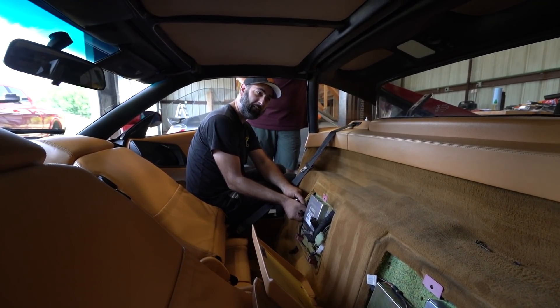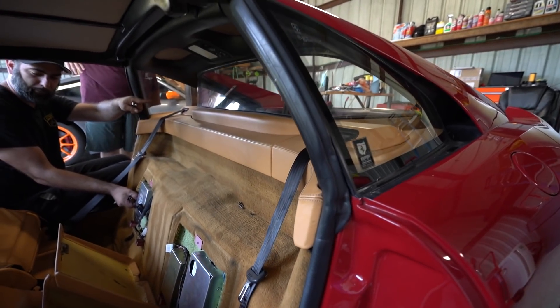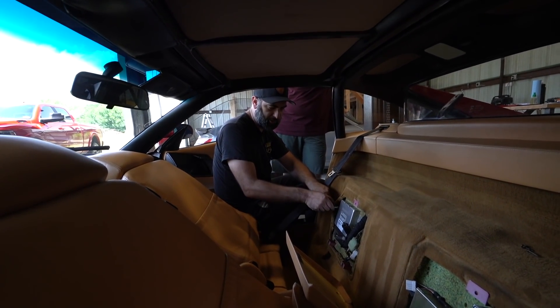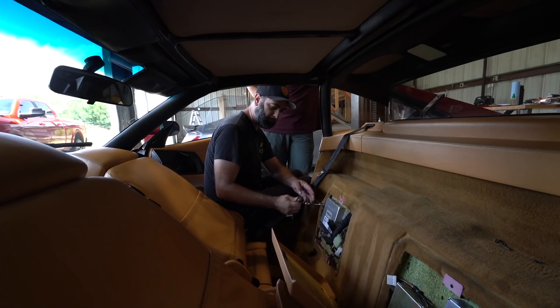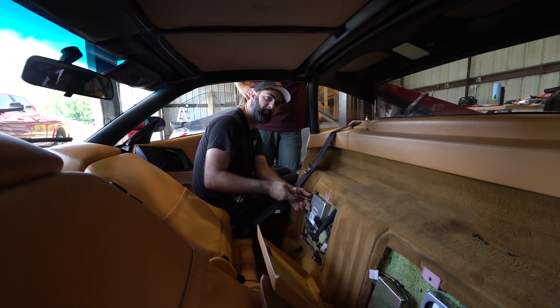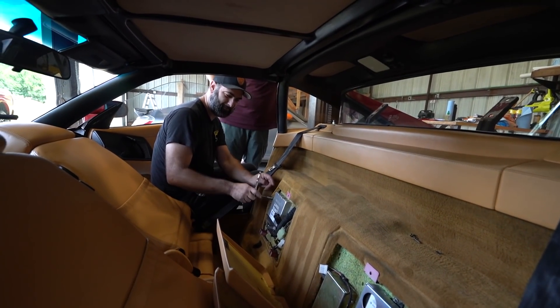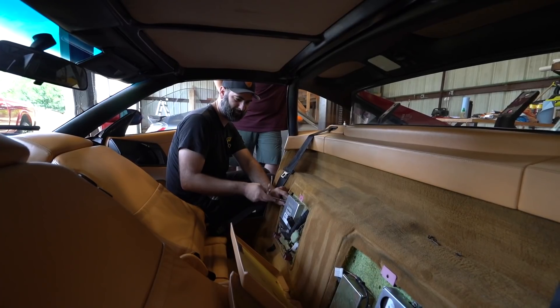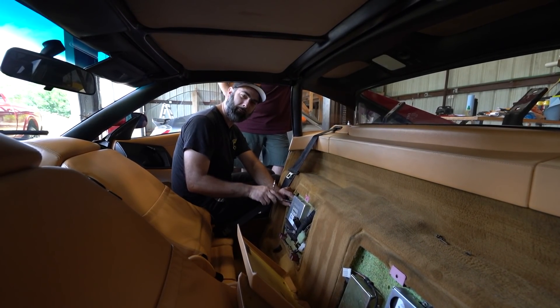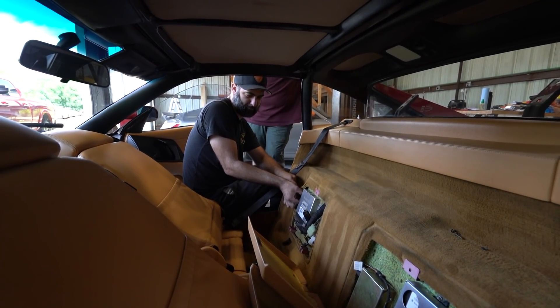The 2.7 355 does have two — they're up in the rear quarter panels, where that bracket is that you unbolted the trim panels from. But this car has a single ECU. Even the new stuff has two ECUs. So this one won't do the run-on-half-a-bank and all that stuff — pretty much, yeah. That's like good and bad, right?